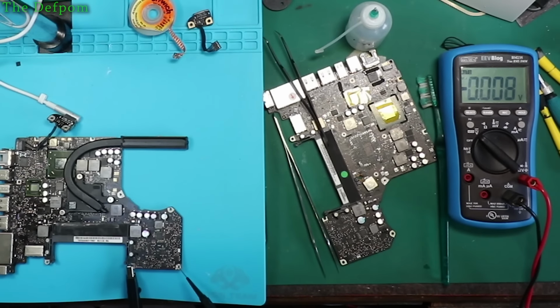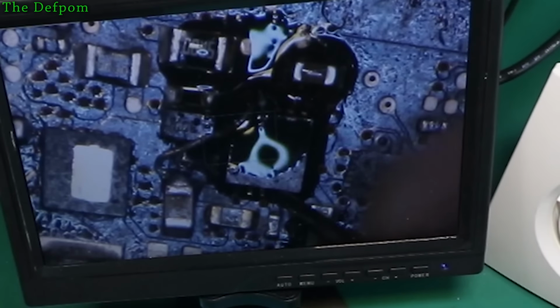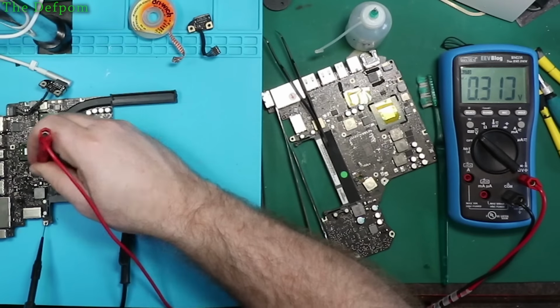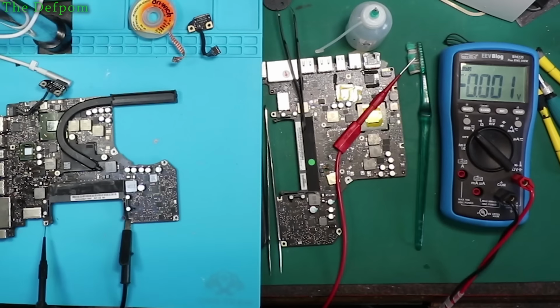C6994, that's a bypass, like a feedback on pin 9. So pin 9 should also have that voltage on it. Yep, so pin 9's got feedback on it. What's going on with this thing? Could it be that this one's blown because of the short that was on that output? Okay, no, I'll just replace the chip again for the third time, just to be sure it's not that.